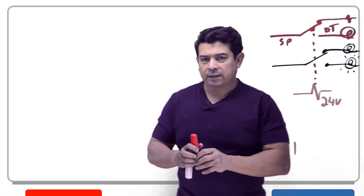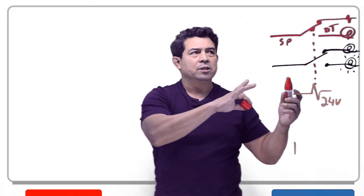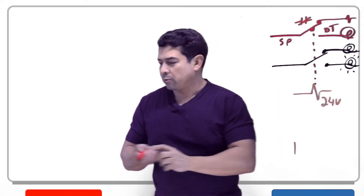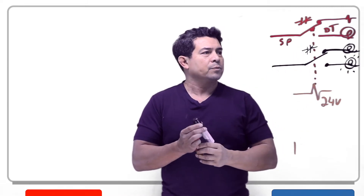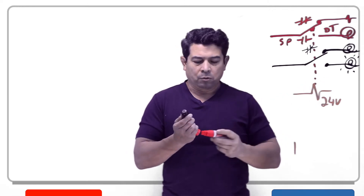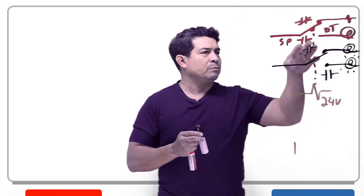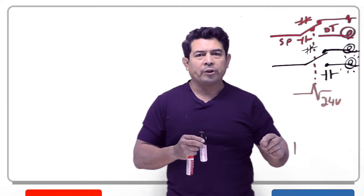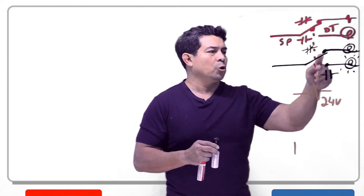Now let's take a look at it a different way. We know that when this is closed in the off position, we can say that this is normally closed. This one would also be normally closed. This one here would be what they call normally open. This one would also be normally open. These are the symbols for normally closed because power is off. This is the symbol for normally open, symbol for normally closed, symbol for normally open. When you put power to this, this is going to open and that one is going to close. This one is going to open, that one is going to close.